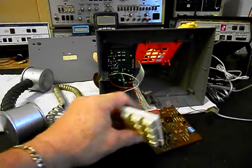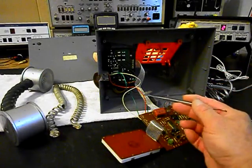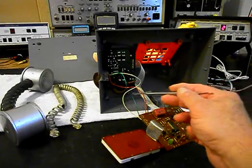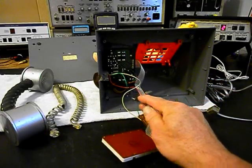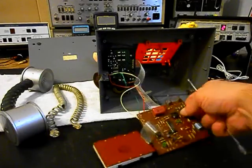We also need to install a bell — a small bell in this area somewhere. We'll go ahead and get that work started. We have our piezo buzzer here, which is original to the unit, but it would sound much better with a bell than a piezo buzzer. A piezo buzzer is the electronic type ringing that you would associate with some telephones, and most all newer style telephones have the piezo buzzer electronic noise on a ring cycle. So we're going to be changing that.